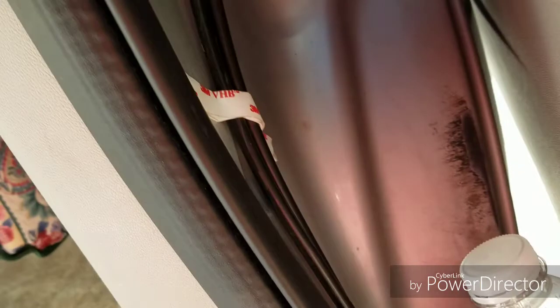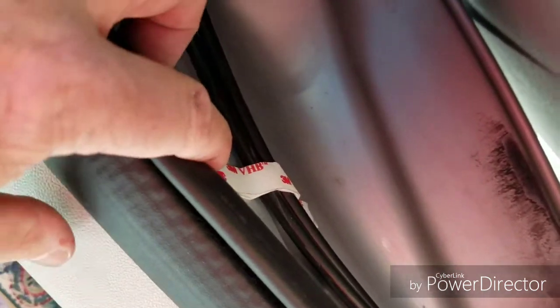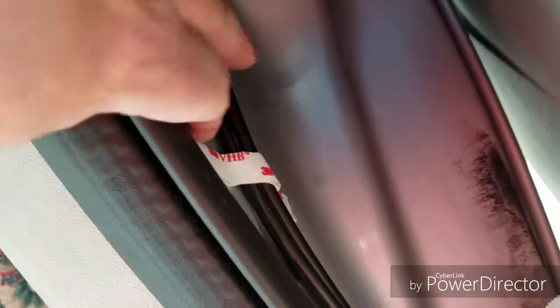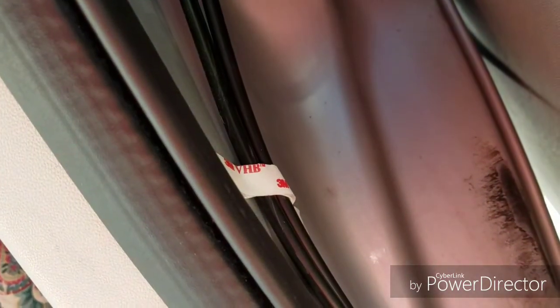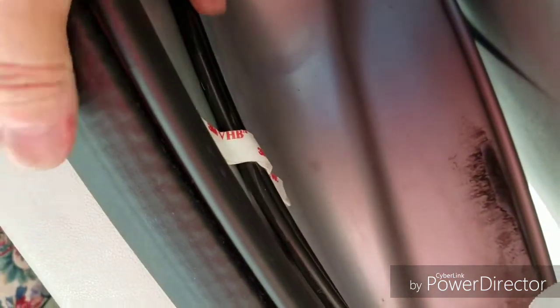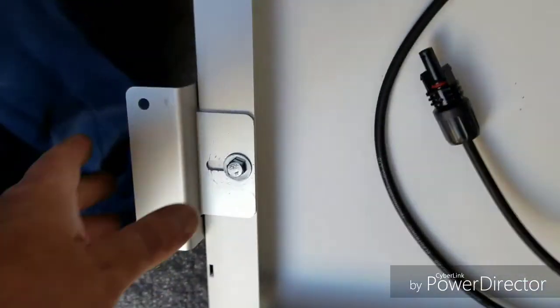What I'm doing here is attaching cables with VHB tape so they don't move too much. First I cleaned the area and then I abraded it with a little sandpaper. It's two-sided tape — hopefully it'll work, it might be just temporary. We'll do that all the way up in a few places to get that attached. I got the brackets on.